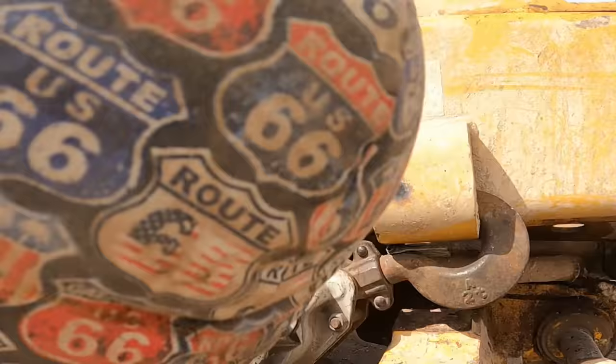Let me go look at the other side. If the other side is good, I'll probably just start gouging and I'll let you guys watch that. All right, this guy didn't move at all. It's flat all the way across the top there. They did attempt to stretch this bottom part, so I'll go ahead and gouge from here and all the way around underneath. On the inside, it looks really good too. I was able to cut enough clearance.